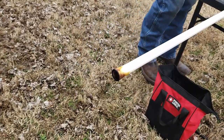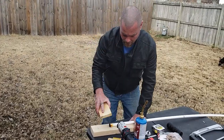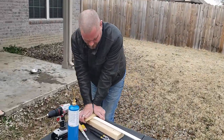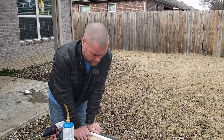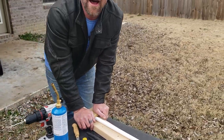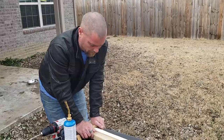She is nice and hot now, so while it's good and hot we take our boards — that's what these pieces of wood are for. Set one board down on the pipe, take the other board, and just squish it together. Really put some pressure on that to seal it. I like to keep pressure on there for a minute or two while the PVC cools and hardens back up. You're going to have to give it probably five minutes to really harden up before you can cut it for the next step.